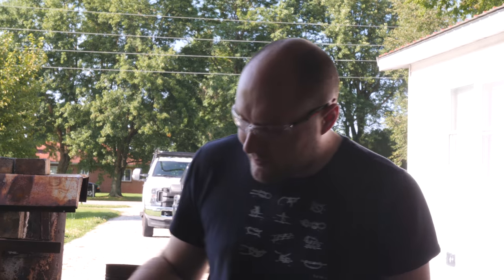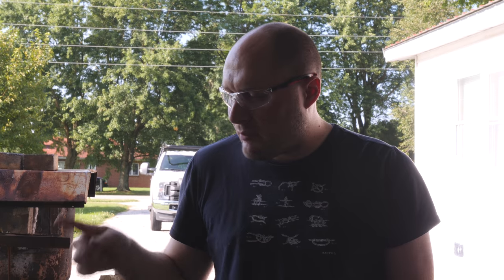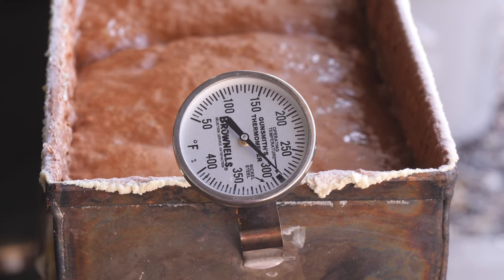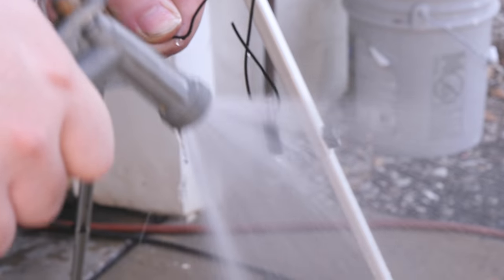They won't get black. Like I said, I like to undershoot it by like 10, 15 degrees, get it boiling there, and then by the time I put my parts in and everything, it's normally getting up close to 290. And it seems like they work from like 280 to 310 or so. They seem to work in that range pretty well.